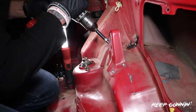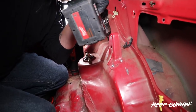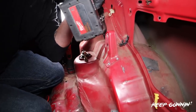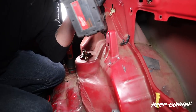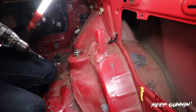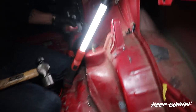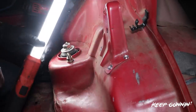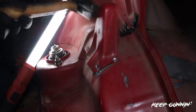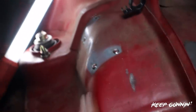I got Forty doing this one right here — I just taught him how to use it. And I took off this side over here, I took out the middle, I got everything right there. So now Forty's just got one more spot weld to get rid of. You have to be patient with it. He's almost done. Check that out — see if you can bang it out. Just hit it to your side here that way and see if it moves off the spot weld. There you go. Now just bend it up and down. Beautiful. You see? You didn't bend the body of the car and you removed it nice and clean. Good job.